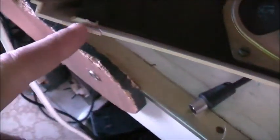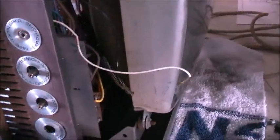Okay, viewers, this is already broken off, so I can easily repair that. Re-glue that back there. Little speaker there, which connects up over here. And the CRT bracket goes on here, molded to the outside shield casing there. That's the implosion band, so it's quite safe to work on this one, unlike a modern CRT, but still be careful. I can align this so it lines up properly, so I'm going to get some contact cleaner and clean up all these controls. Because this type of dust gets in everything.